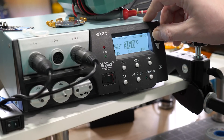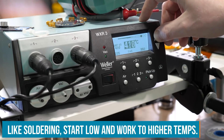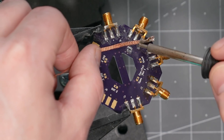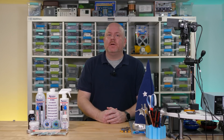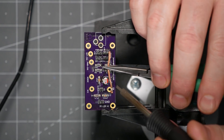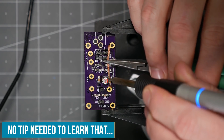So how much heat should you use? As an example, when using leaded solder, I solder around 350°C. When I use Super Wick, I'll take my temperature as high as 425°C. When soldering a large heat sink like a copper pour or ground plane, I'll take my iron as high as 450°C. Don't forget to bring the soldering iron back down to normal temperatures, otherwise you might shorten the life of your tip. One other community member suggested cutting the wick so that there is less heat-sinking action. You can use pliers to manipulate the wick, which also prevents you from burning your fingers. Be careful when cutting, because it can change the braid.